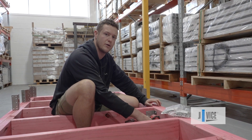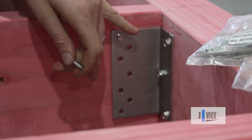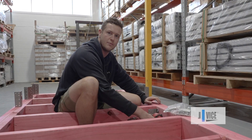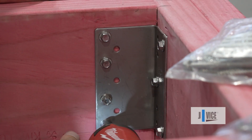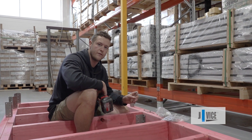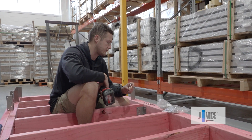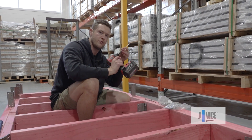One of the main things you'll notice is that the JVice is actually 80 degrees. That's because when we place it on the joist it sticks out a little bit, so when we screw it off it pulls the joist immediately under tension, giving you a stronger timber connection. Now that we've put the 44mm tech screws in, there are four screw holes left on the boundary joist side for our 88mm tech screws for the double boundary joist — or 125mm for a cill.